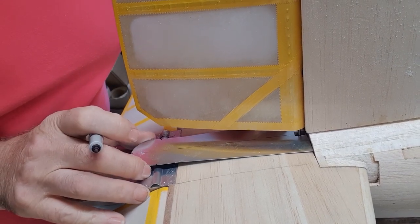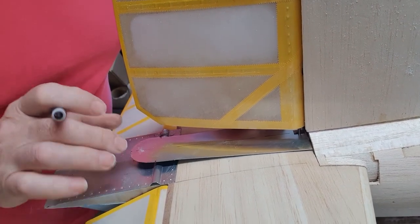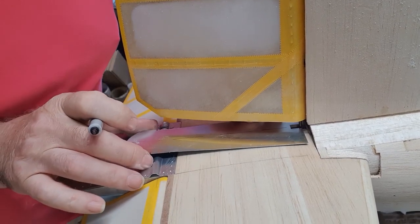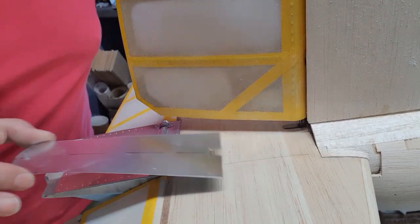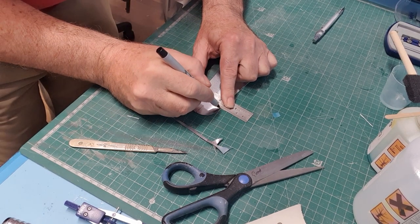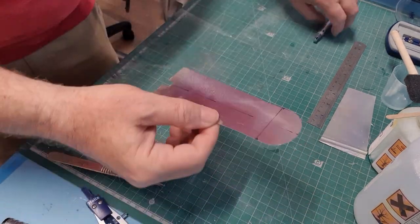And what I'm going to do is actually lose a little bit of that end. So I think what I'll do is I'll offset it slightly, a couple of mils this side, because I want the back to be in the right place. But because of this lifting, the radius or the distance is going to be greater because it's got to go over the ridge. So I'm going to shift that to that end. That'll make that end just a little bit too short, but this is all going to get covered in foam and filler anyway. Okay, so if we come back over here, I'm just going to add a couple of mil to that line. And then that is the center line of the raised hump. So let's go get the dapping blocks, tools, and we'll put that ridge in.